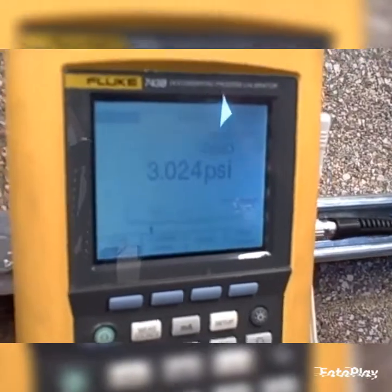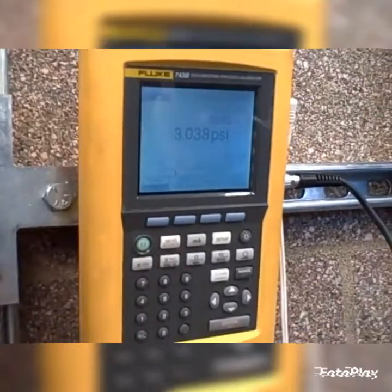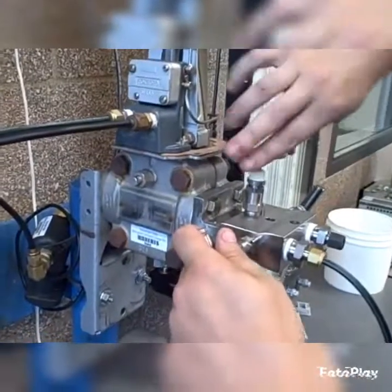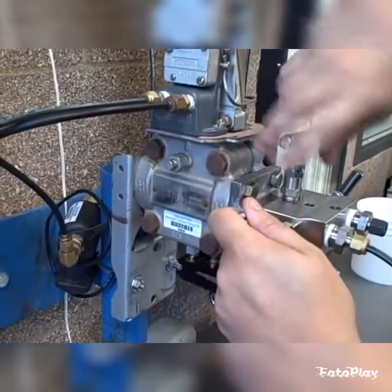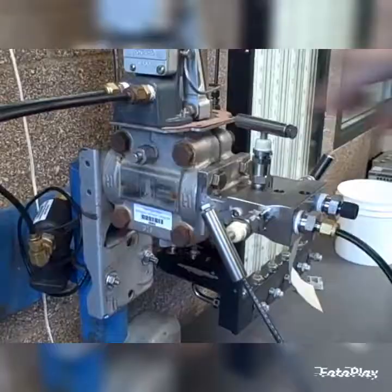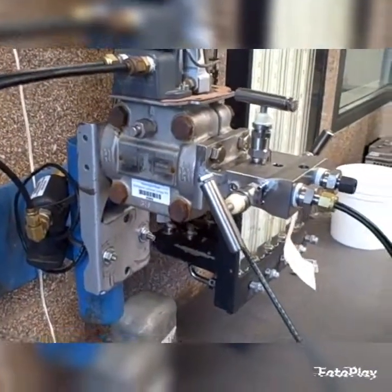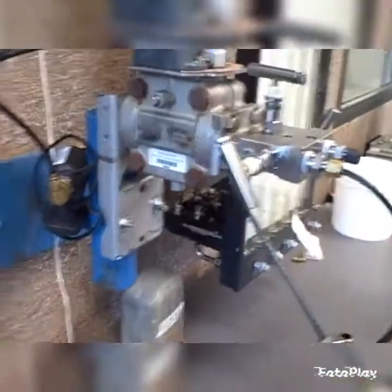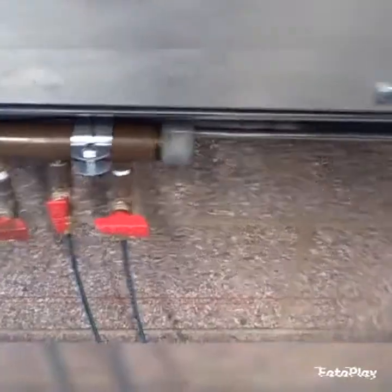He's shooting for three. When you go back to high pressure, it's going to be messed up. So now he's going to move his manifold to apply pressure to the high side again — 34 inches of water column — closing the equalizing valve and opening the block valve and adjusting his regulator.